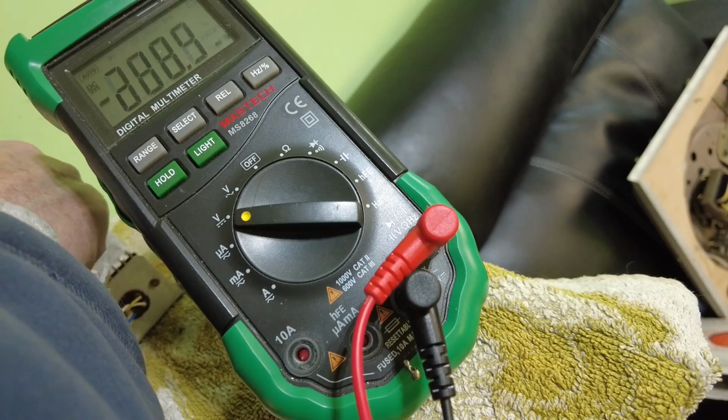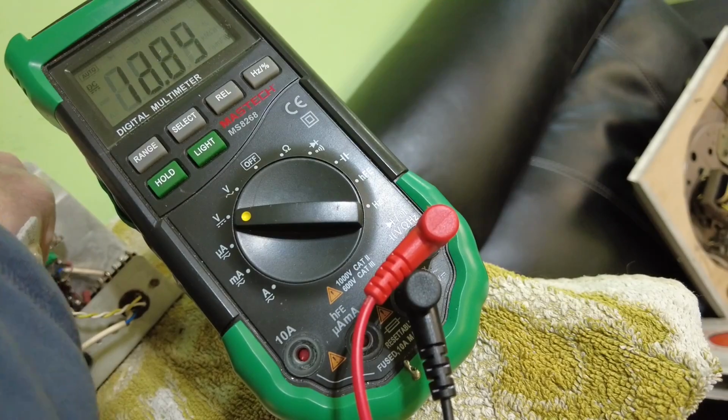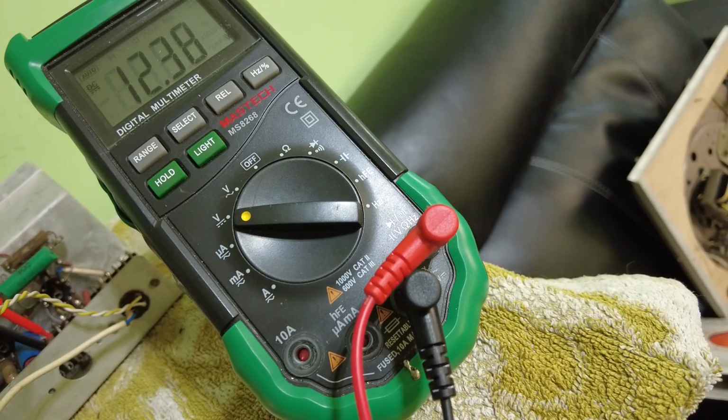So there's the other cathode resistor there, that's 220 ohms. We have got cathode bypass caps on there. So let's just see what we've got on that one. And that's got a drop of 12. Now again, I've not measured those resistors, they could be out of tolerance, so I'm only guessing this. We're doing this roughly because obviously we're looking for a fault, so that's a massive amount of current. So on this one we've got 12.24.